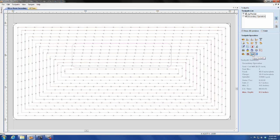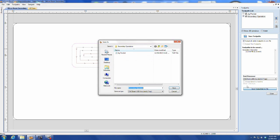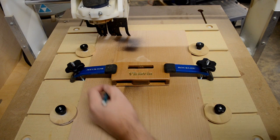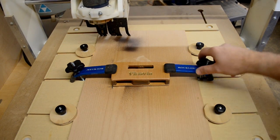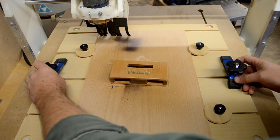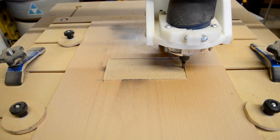The pocket simply has to be maintained as a separate operation from everything else. Even though I'm using the same tool for both operations, they're being sent as two separate TAP files out to the CNC Shark. I've clamped a piece of quarter inch scrap down to my table and set my part in place roughly where I want it. I mark the rough location of the pocket and a specific point to set my X and Y zero to, then cut the locating pocket with the Z set specifically to this piece of scrap.